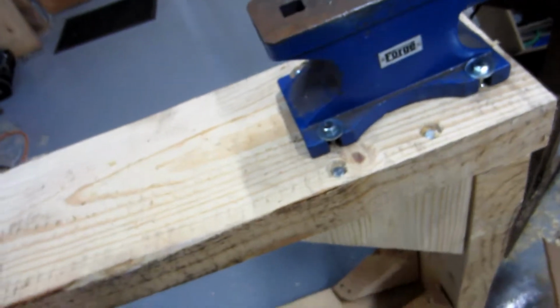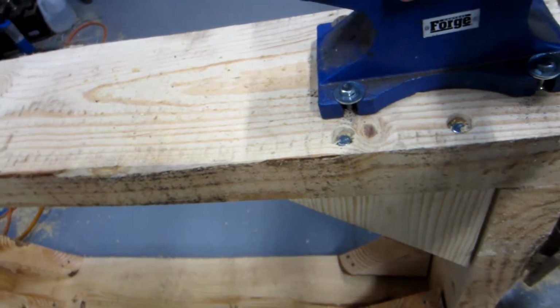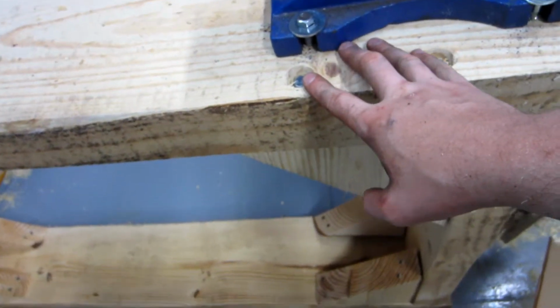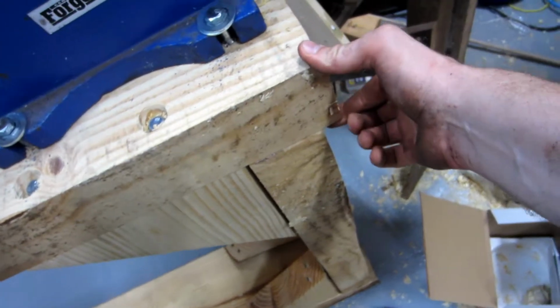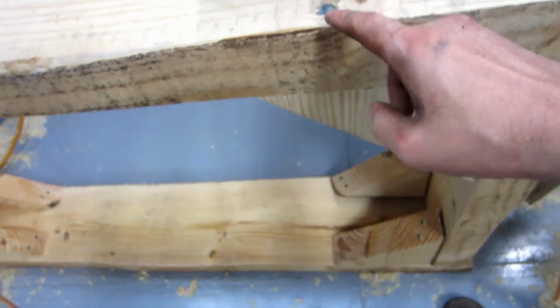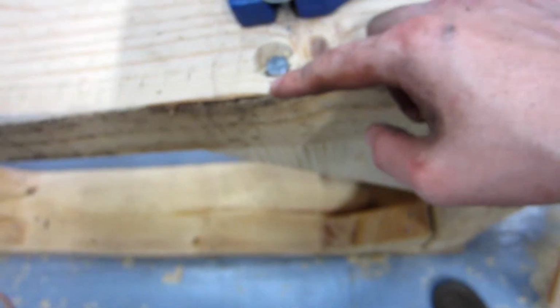In case you're wondering about building green like I did by simply cutting down a tree and turning it into this, there are definitely some drawbacks. You have to pre-drill everything, and as it shrinks, there is a strong possibility of cracking. That's one of the reasons that these are such thick cuts. These are 3 inches thick. You should also avoid corners and edges when you can.